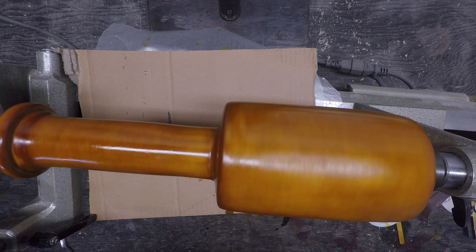And then when I went and I sprayed on top of it, it was grabbing the moisture from the air and then going onto the wood surface. You can see it right there — they're starting to misrun, and I'm getting little voids and fisheyes all over the place. Was it from my fingers or was it from the moisture? I'm going to say it was from the moisture in the air — it was just so humid.